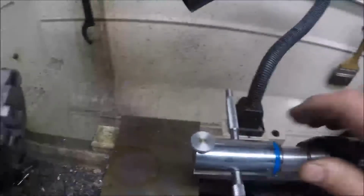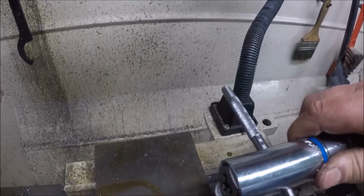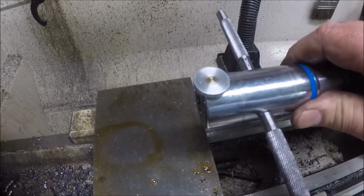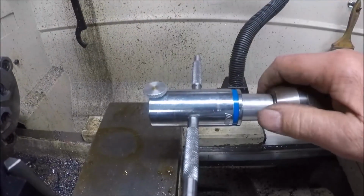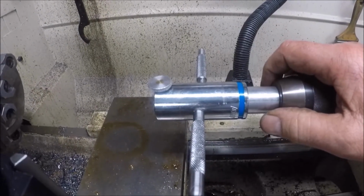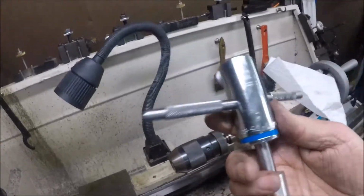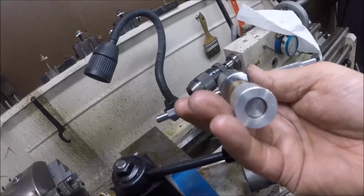Okay, today this video is going to be about making this wrench. Now I kind of made them a little offset for a reason, and everything is kind of measured up. So this is my tap wrench. This is the one that I made to hold my dies with, and I'll take it out. Basically, it's fairly simple. It's just a socket that I've drilled and tapped out. I got a bushing. I bored the back of it out, and then I made these two handles here.